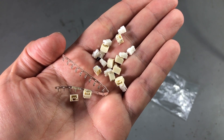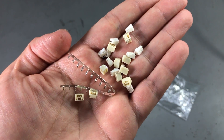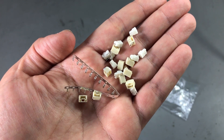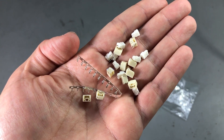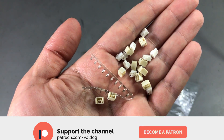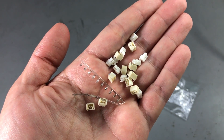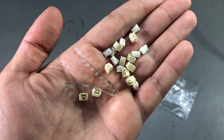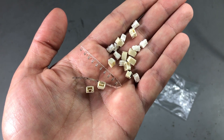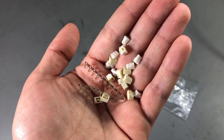From the same seller I also ordered some 1.25mm JST GH connectors — surface mount, 2 pins. These are ideal for connecting small batteries or other signals to a PCB. JST GH is rated for 1A, 50V, and 26 AWG wire size for crimping. The metal crimps are really small, so if you don't have a crimp tool you can find ready-made crimped wires with these connectors. I can already imagine how these small connectors will look paired with teflon-insulated wire — very professional.